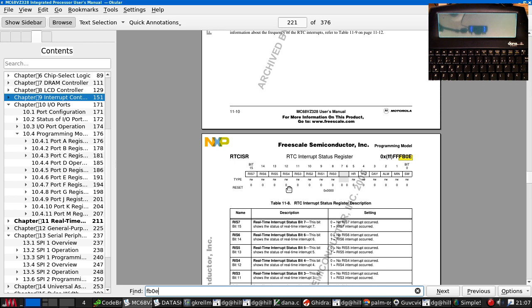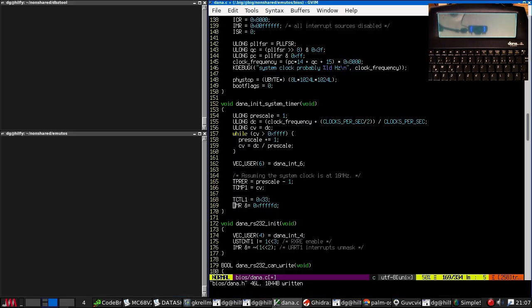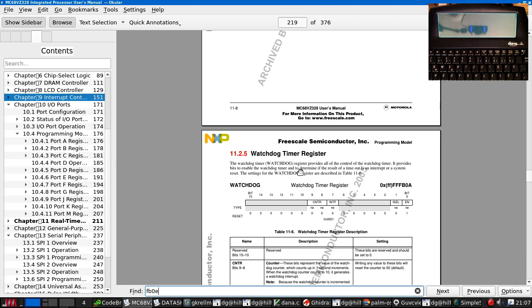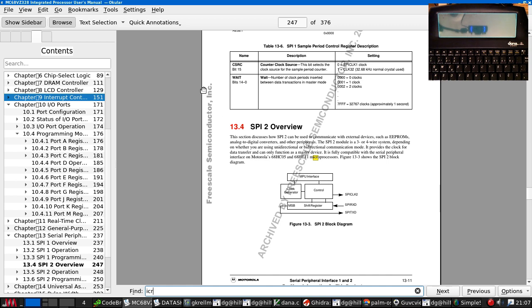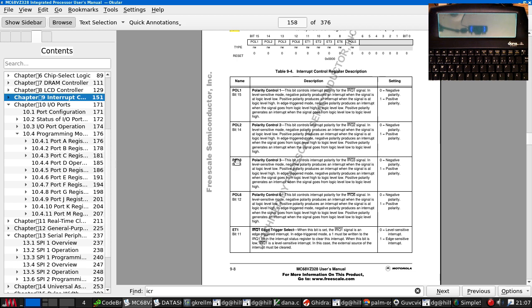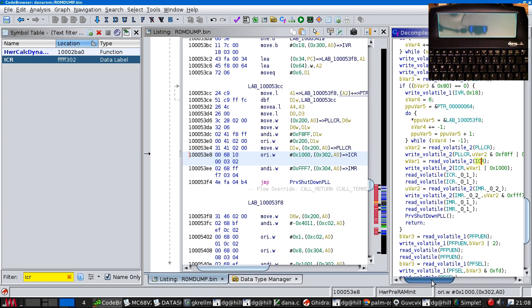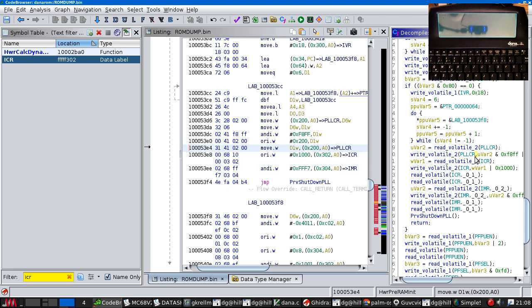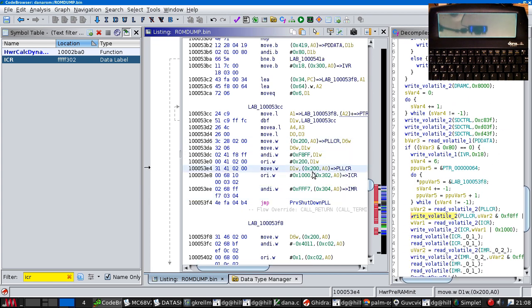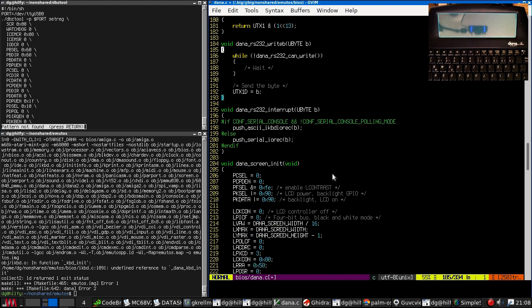No, we're not. Because the timer arrives on that vector, but it is not IRQ6. This is an external interrupt coming from something else on the system, and we don't know yet what that is. Interrupt polarity for the IRQ6 signal. It's all mixed up with the PLLs, I have to say. Well, the system seems to work without it, so let's ignore that for the time being. Okay, so let's assume that this is all we need.